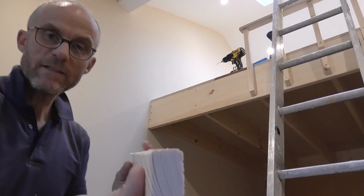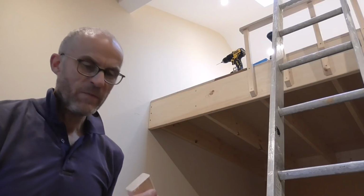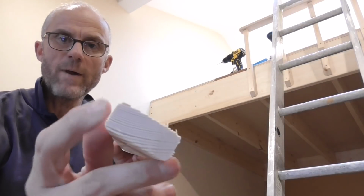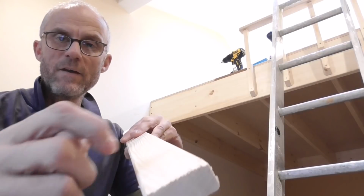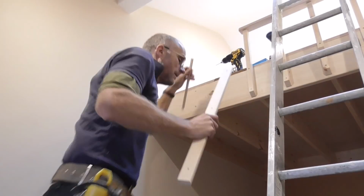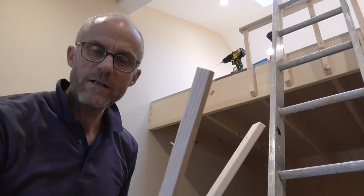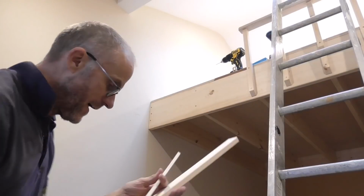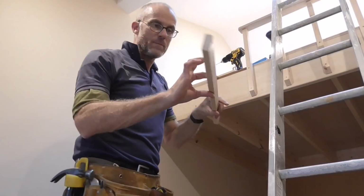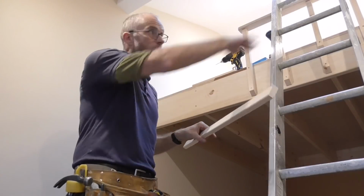I've made this edge piece, as I said, and what I've done, if you can just see, is rounded both the corners on the front and just rounded the corner on the back. This will sit up and let the carpet go into the back of it. What I've done is cut, let me just show you. I've just cut a little spacer, it's about 14 mil, so I'm going to put that on the face of the ply here, back of the ply there, and keep this to the top of it, and then I know it'll be right all the way through.